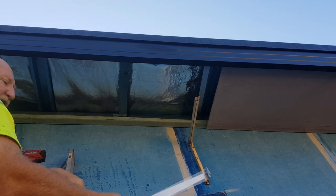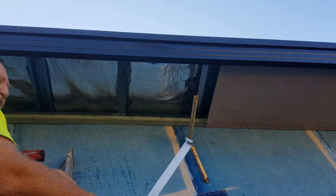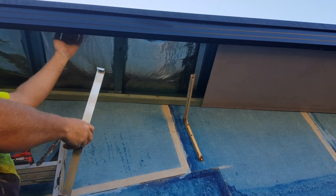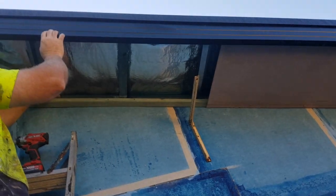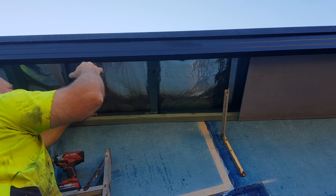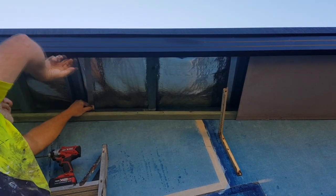There might be a commercially available version of what I've made up, but I've got some metal strapping left over from when I did the hot tub and I've made them up into a hook that fits on the inside of this metal fascia and then ties back to the inside of the board so that I can tension it tight enough to hold the boards in place and stop this metal from flexing out whilst I'm trying to get it into the groove in the underlying edge.